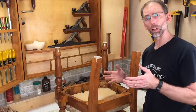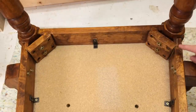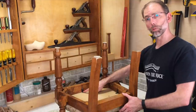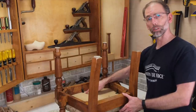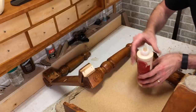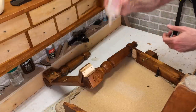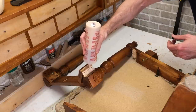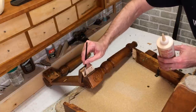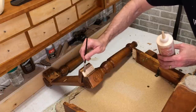This is a perfect example of why dry fitting matters. I've got an opening right here, and if I close that up, it opens up this area here. So I've got an angle bracket getting in the way of my glue-up — I'll take that out first. To glue this up I'm using a PVA glue, one that's not expired. I write my own expiry date on the bottom about a year from when you open it. I always use an artist brush when I glue things up, to make sure I've got glue on all parts consistently and spread to maximize the glue surface.